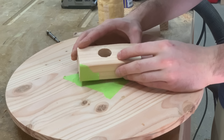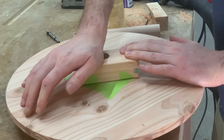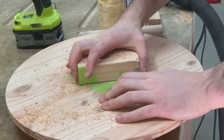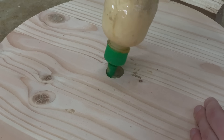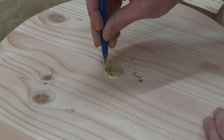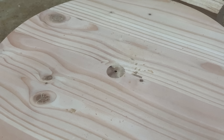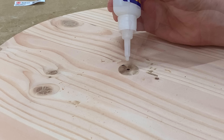Here's another screw-up. Since I cut the bevel on the wrong side of the tabletop, the small hole from where the router circle-cutting jig was secured is now completely visible on the top of the table. Rather than fill that with glue and sawdust, I decided to draw more attention to it — because that's the perfect way to hide all of your mistakes. I drilled out a one-inch hole and hammered in an offcut from the bottom of the rounded leg. There's still a small hole there, but I'll just fill that one up with some CA glue.